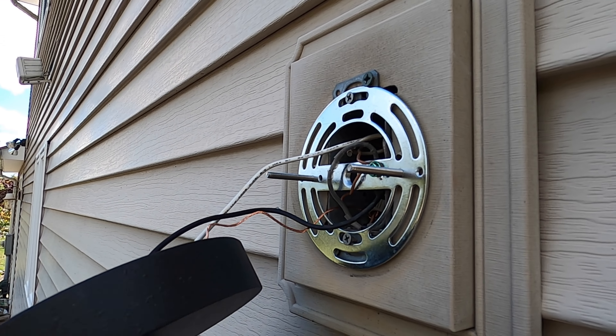You can put a little bit of caulk back here. You can see this is a vinyl siding block that's gotten a little warped from the sun over the years — it's a little cupped in. I have good contact on the fixture all the way around, but at the top there's a little bit of a gap. So what I'll do later is put a piece of blue tape on the fixture and come in with some tan caulk, put a little bead around there, and smooth it out with my finger just to close that gap up.